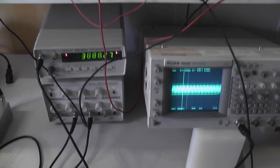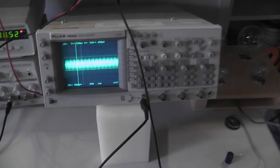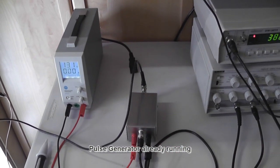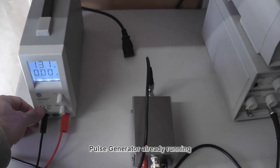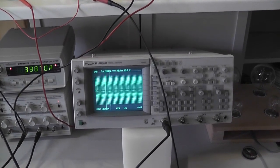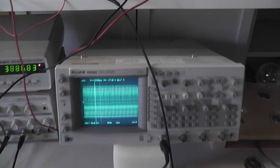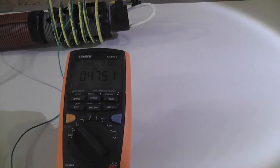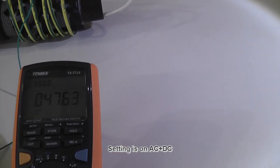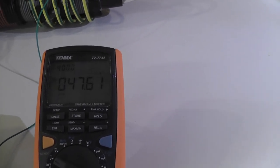We have a similar scenario. I just start only my pulse generator — at the moment it is around 3.8 MHz — and I get around 1V. Now I start my pulse generator and power supply. We have overshoot. The scope reads about 90 volts, and the DMM says 48 volts. On the AC side it reads about 47V, and on the DC side it's 47 volts as well. So that before was AC plus DC; at the moment it's DC — 47 volts on DC.